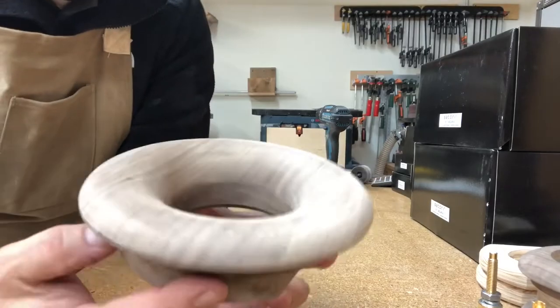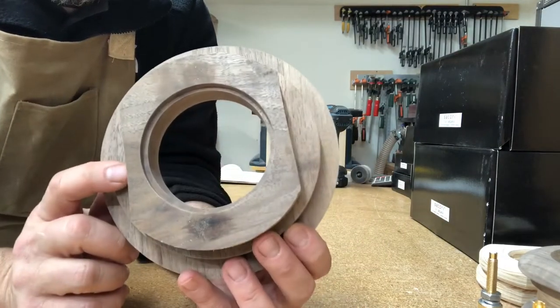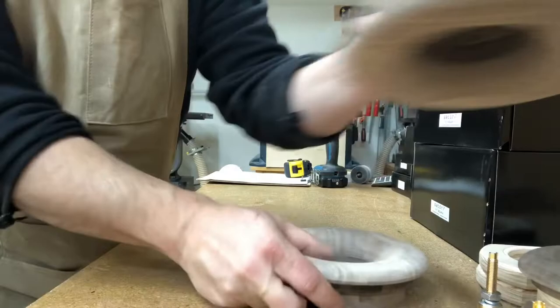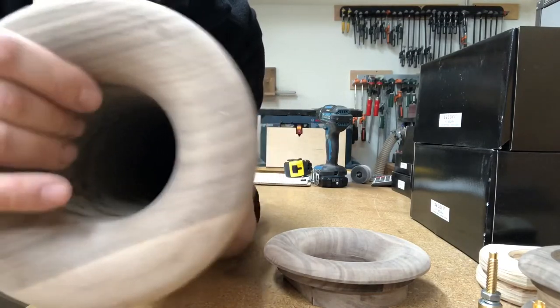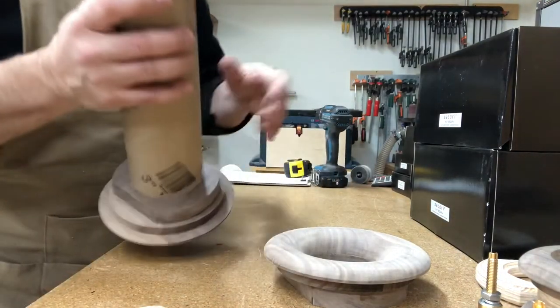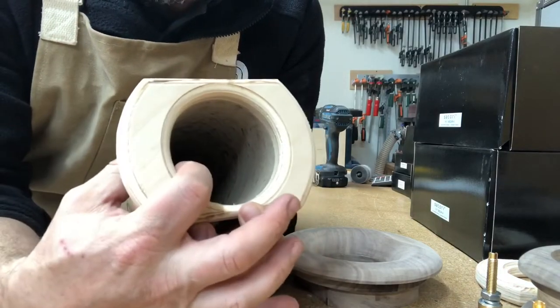There's not a lot of figure in the veneer either, so that's fine. These are the port provisions I did a post about. These are flanged and I'll eventually glue them into the cabinet just like you would a port tube. Here's the port tube installed in the receiver groove — you can see it creates a really nice smooth transition with no step or anything like that. I'll paint the port tube, and on the other end there's a quarter-inch radius to smooth out the airflow.